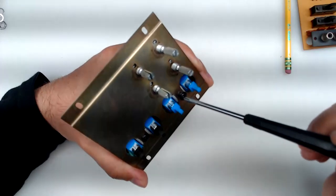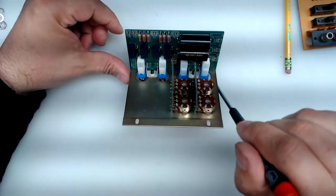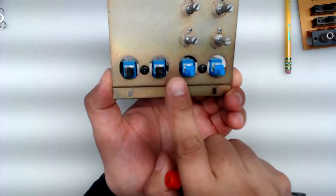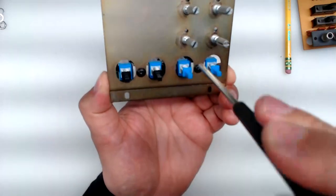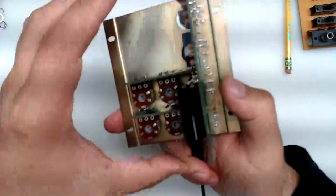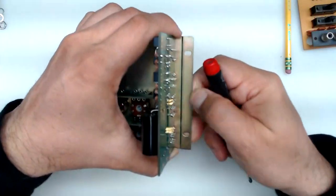The first thing to do is make sure the board width and the plate width are the same. When holding this in your hand, keep your screws fairly loose so you can line things up — this will help you center the assembly so the buttons don't rub on the plate. There's very little room between the buttons and the plate, so if it's not centered properly you'll have a problem. Tighten the first screw on the left, which has a round hole, and leave the other one loose while you guide the board parallel to the plate edge.